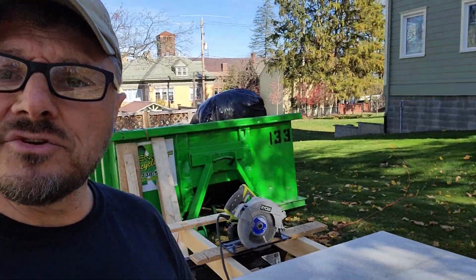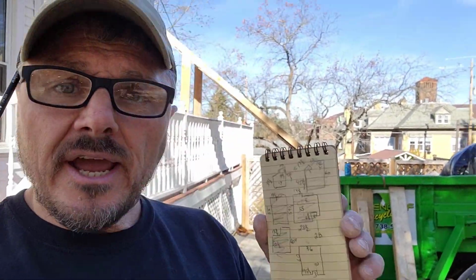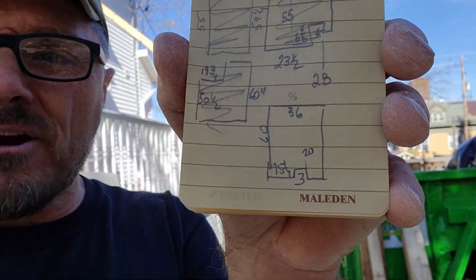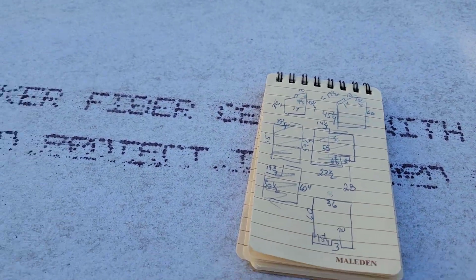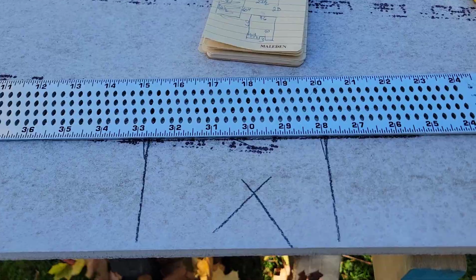As I'm coming down here to get ready to cut these, it's half inch Hardi board, Hardibacker, I guess it's called, and basically just doing a series of measurements because everything I am doing is a cut. I haven't installed a full sheet yet, and I don't know if I will. So, you know, it is what it is. Fortunately, I'm good at measuring for the most part. And so I'm working on that lower piece right there, just a notch out for a partition wall. And there's the idea. Measurement there, because I'm using a full 36 and a full 60 inches, and this is 3x5. All I have to do is take that notch out.